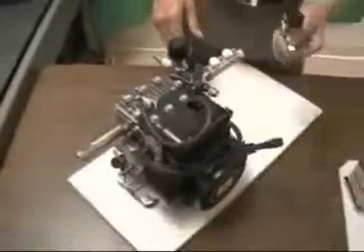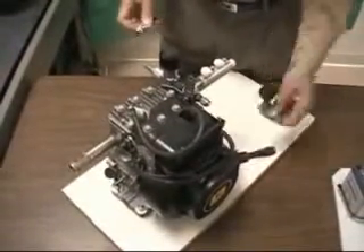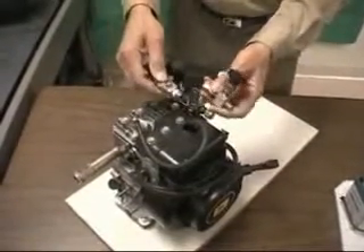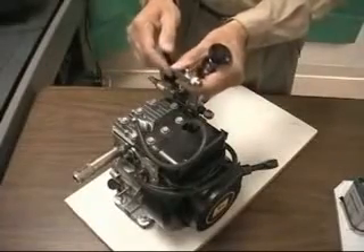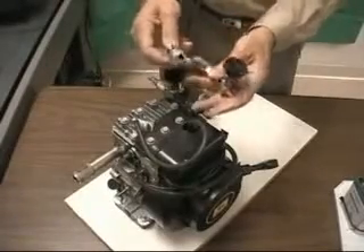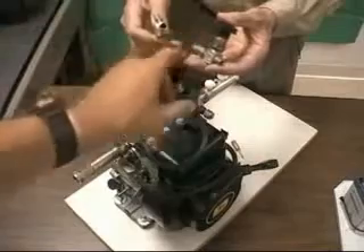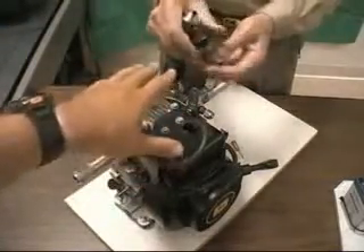What we're also showing is the ability to run this by setting up one valve — that is the idle valve — and then you can set up a valve in parallel that gives you the ability to put this on a remote foot feed, so that you'd set the idle RPM at say 1,000 RPM. So basically we're going to run hydrogen through this fine control needle valve for idle speed — just enough to keep the engine spinning.